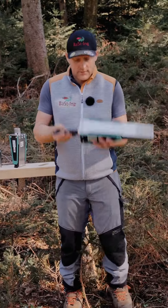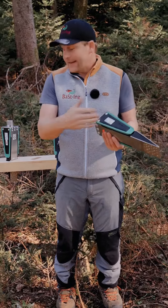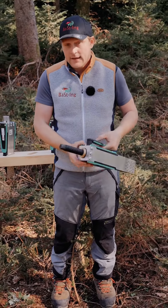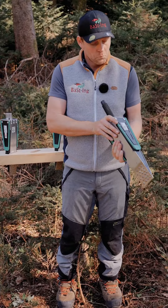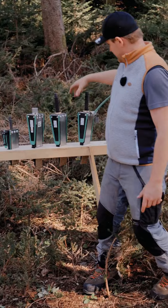Now we come to the Maxfall — our largest spindle wedge. The partially integrated spindle also extends further than the Volfast. It also has a 14-degree wedge angle, 30 tons of lifting force, impact wrench up to 2,000 Nm, and also the 24mm wrench size. A very robust, solid wedge, but it has more weight than the others.